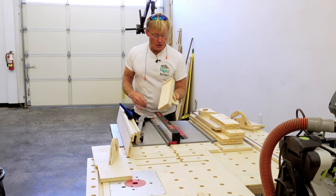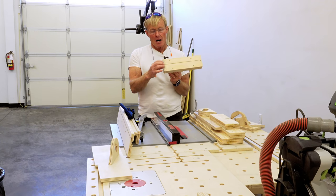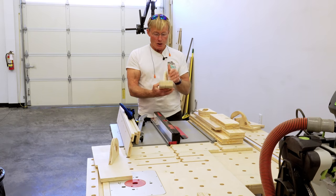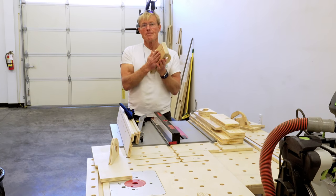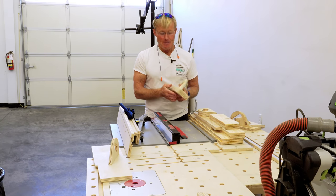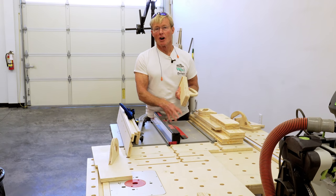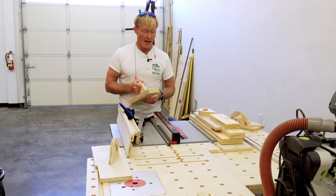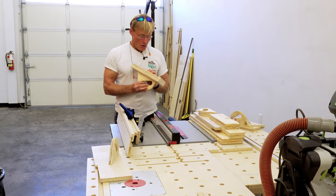In addition to having the fixed lip on the back that is glued on — not screwed on — I also wanted to put the handle on without screws. I don't want any metal in this. I don't want to hit any of my table saw blades with metal, but also in the SawStop, metal will cause it to activate the brake, which brings a price — I have to replace the brake and oftentimes have to replace the blade as well. So that was critical.